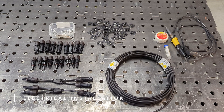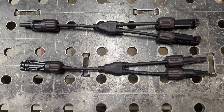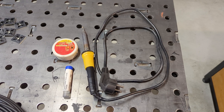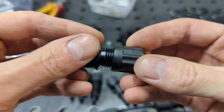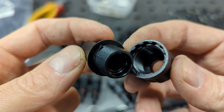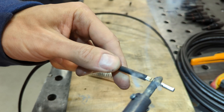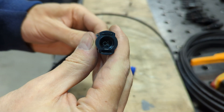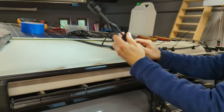For the solar installation I used 4mm² cable, connectors and some other small accessories. There are some electrical rules to optimize the charging capabilities of a solar system. For example, if you have a 12V battery you should have at least a 24V solar panel for better efficiency. Current is important too versus battery capacity. I was limited by my rooftop tent surface which is not even, but I think I mounted as much as I could.